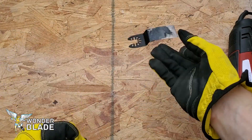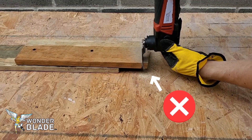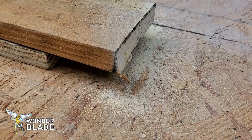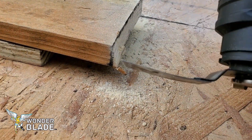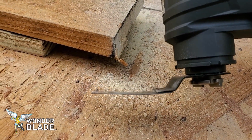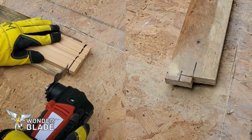Now why is this blade curved? Why is it not straight? It can be for a number of reasons. Number one, regular wear and tear. Number two, it's not a good quality blade. The number one thing to emphasize before making a straight cut with an oscillating tool is the blade. As you can see here, this cut isn't exactly straight because the blade isn't straight — it's curved. If you have a lower quality blade, the chances of this happening are extremely high, which is why it's always recommended to have quality oscillating tool blades before beginning your cuts.